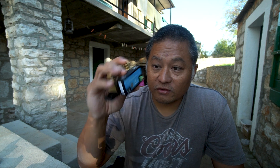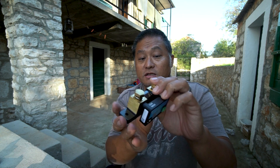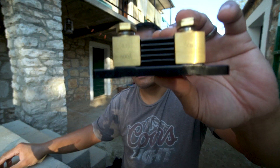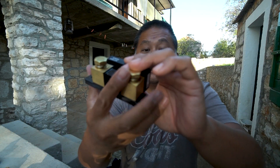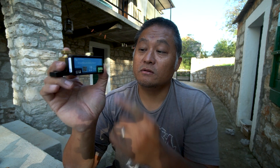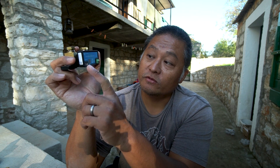This is a 500-amp shunt — you can see the size compared to the 120-amp shunt; it's much bigger. It's also really easy to install: connect your battery and negative, and one wire to 12-volt power. There is no physical monitor — you use the Victron Connect app. There is a way to connect to an external monitor Victron sells through the VE Direct port, but I'm not going to use that.